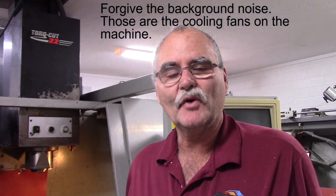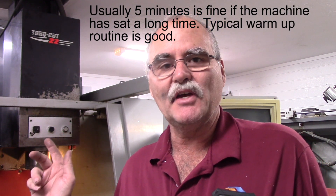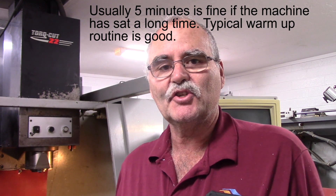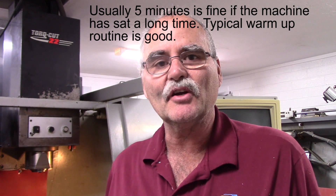This is just a brief demo of the Torque-Cut 22. I've never really run the machine in any programs. I've homed it — home is fine. I've jogged all three axes. I can run the spindle up and down. It does have the transmission in it, and it's 7,500 RPM. The thing about the transmission is you've got to warm up that spindle before you start using the machine so that it shifts properly. I believe under 2,000 RPM it shifts into low gear. Let me demonstrate the machine running.